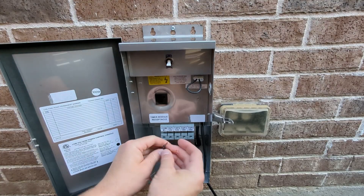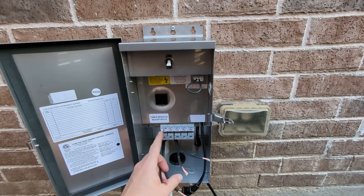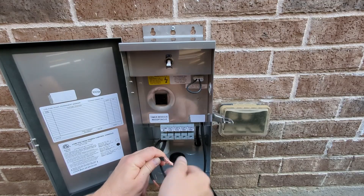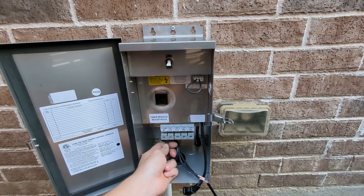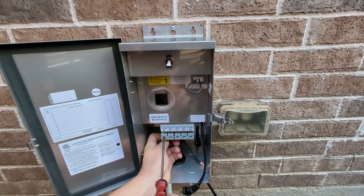That's a good length. You want to split the wires apart because you're going to be plugging one end into one terminal and the other half into one of the other terminals — 12 volts through 15 volts. So with two main wires, you'll have two wires twisted together going into the commons. This is the same if you have three, four, or five wires — put one half of all the wires into the commons, and the other half into the 12 through 15 volt terminals.